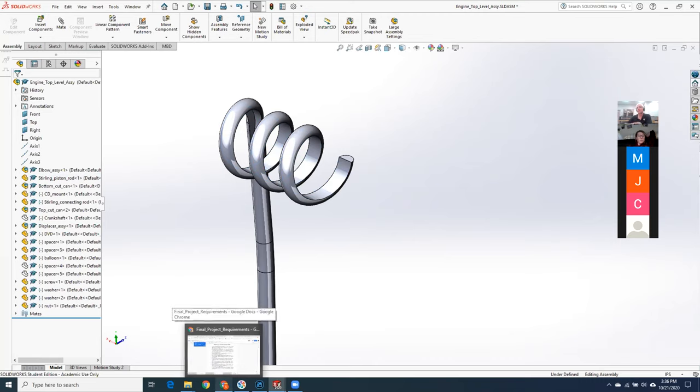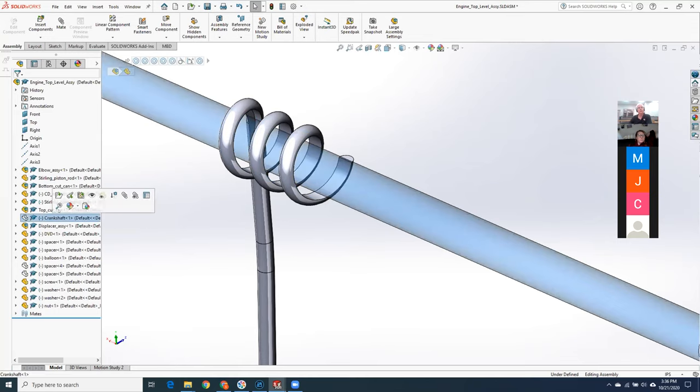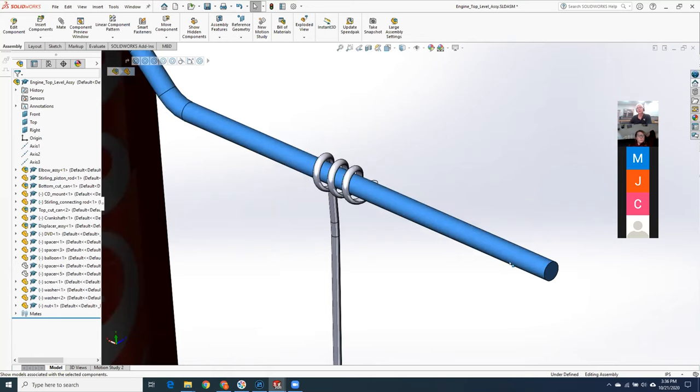I have a question. Yes, ma'am. How will we know what the radius of that should be? Okay. So this crankshaft is made out of 1/16th inch diameter welding wire. So you know the outside is a 1/16th. If you wrap that wire around and you left, say, 0.01 inches of clearance, you could make this hole something like 0.07, and that would be absolutely fine. Okay, thank you.